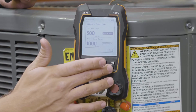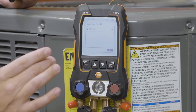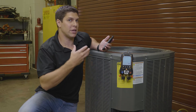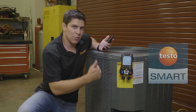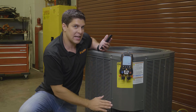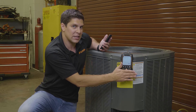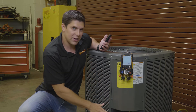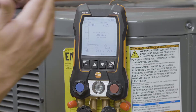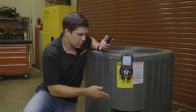We're going to set our targets. I'm going to go down and hit OK. It's going to be looking for the 552i. The 552i you can purchase independently — it works with the other smart probes as well. You can run it with just the app, or it will connect directly to the manifold. Using an external micron gauge is very beneficial because you are not messing up the manifold on the inside because of the different pressure sensors. Having the external gauge with your pump hooked up to the circuit, you are able to get all your results right here on the gauge.